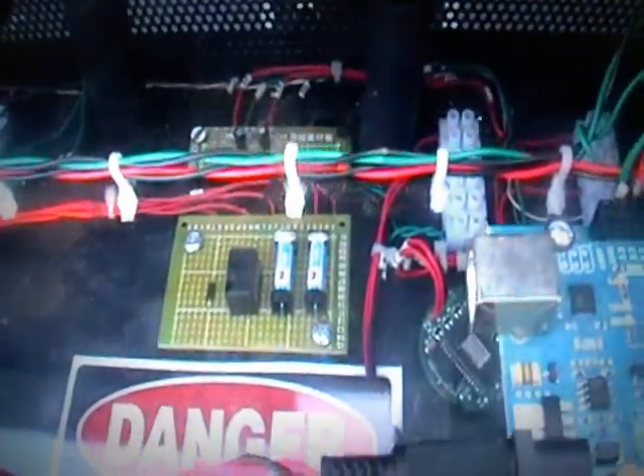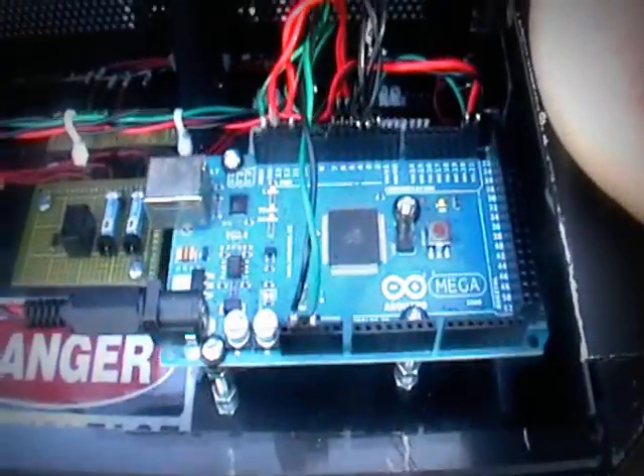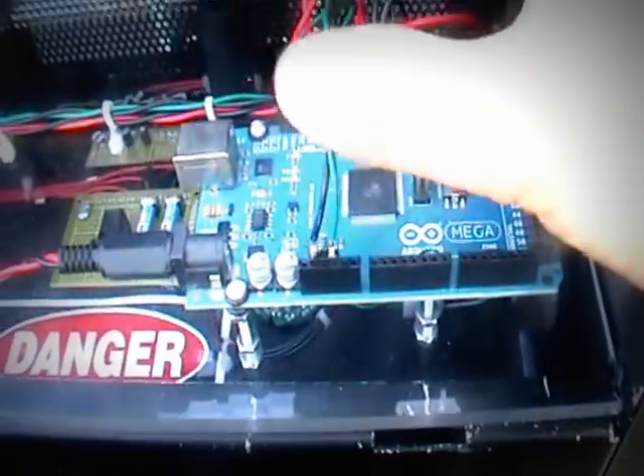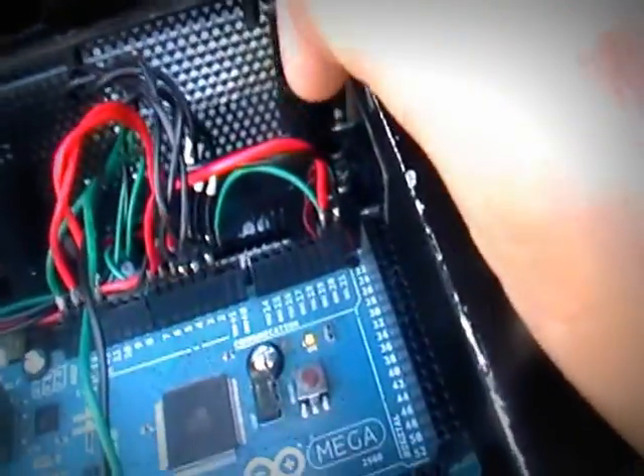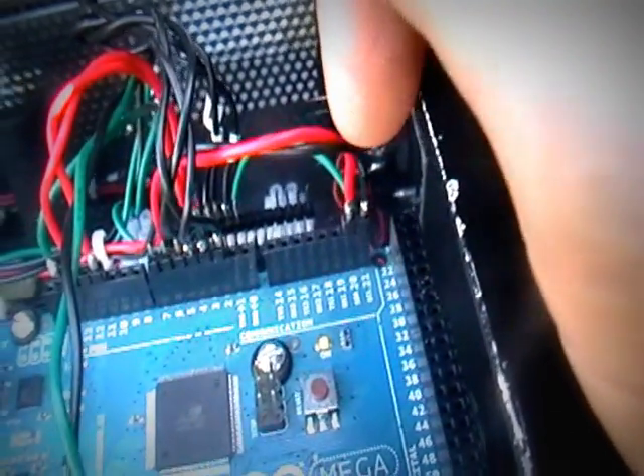I've got some relays — all my electronic hacking is kind of in there. The three relays control the Nerf gun and the up and down of the wheelchair itself. So if I could explain these connections: this black and green here, that's my 3.3 volts and my ground to my Nunchuck. The data and clock from the Nunchuck are a middle black and red pair. Those two wires go to my SDA and my SCL pins — pins 20 and 21 on the Mega. That's your data and your clock.